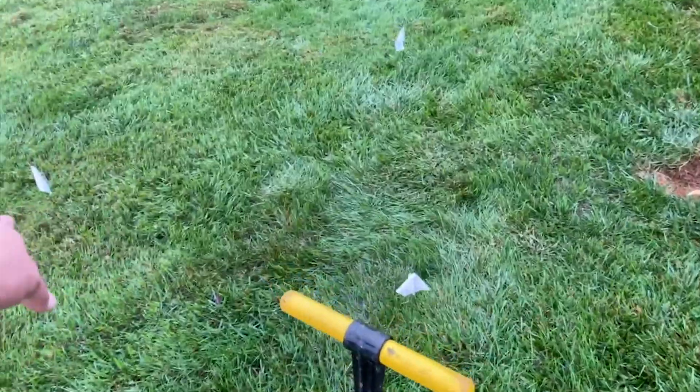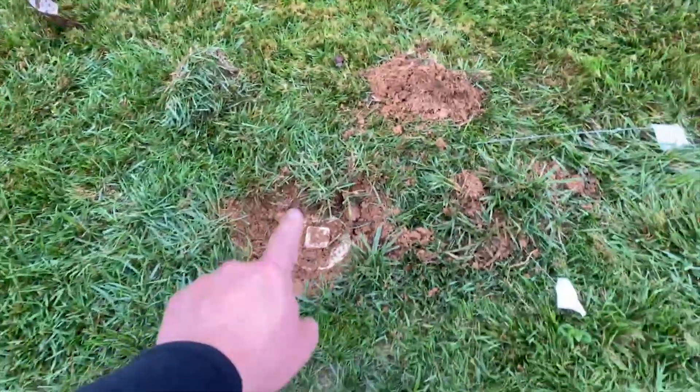We can see here that we have the back of the tank — edge, edge — and because we knew how everything was oriented we were able to find the clean out. Homes from the 90s in this era would have PVC clean outs as their access point, so unfortunately with a metal detector you won't really find that. The only way to find them, especially when they're buried — this one's only about two inches below the surface — is to figure out the orientation of the tank and start poking around with the probe. Once I hit it, we dig it up and hopefully when we pop this open we don't find any shenanigans.